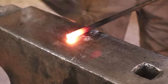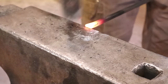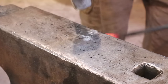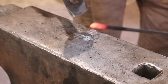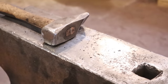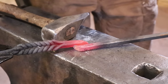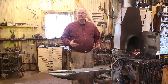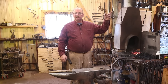I'm going to do the same thing with a piece of 3/8 square bar. I'm going to upset it a little bit and create a scarf. These two pieces then should go together just like that. We have looked at this kind of welding before - a scarf weld, or in this case often called a drop-the-tongs weld. I'll link to a video that covers that up in the left hand corner so I don't have to completely explain the entire process here.